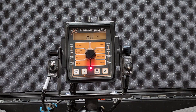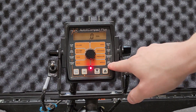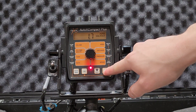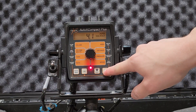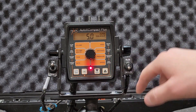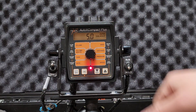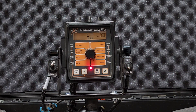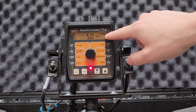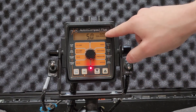To wet test the pump system, put in your desired rate, switch your knob over to test speed. It'll always start at zero — press and hold your up arrow until you get to whatever speed you want to run at. Let's say I want to run at five miles per hour with six gallons per acre. Make sure section one switch is on, and if you have a second and third section valve, turn those on as well so you can get flow going to all your rows. Put it in run and your pump system should be running. Put it back in hold and your overall master switch shuts the system off.